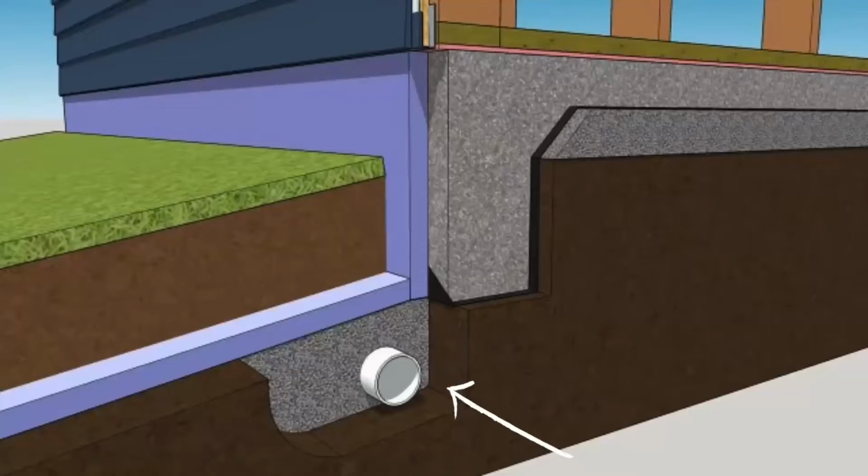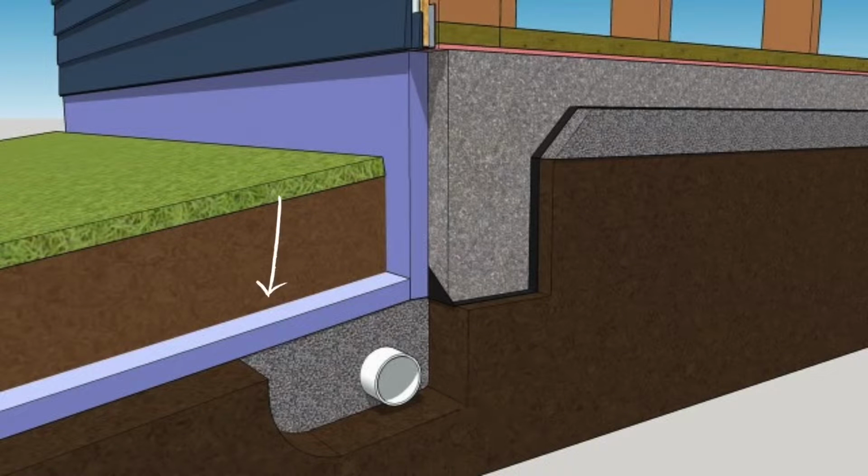So today we're doing some drain tile and insulating details around the slab at the Hidden Gem. And as you can see here, this is what we're planning on doing as far as where we're putting the drain tile. We're covering it with 3/4 inch stone and then putting the insulation board on top.